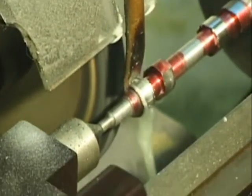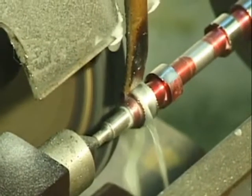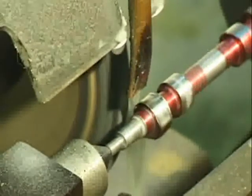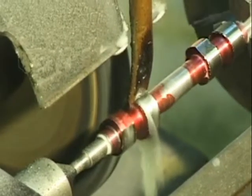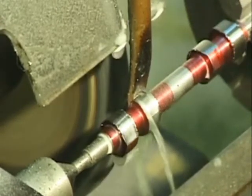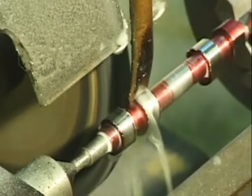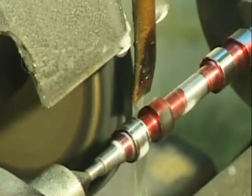You can see the Y-axis and the rotary axis are both moving at the same time. Therefore the Y-axis is moving in and out as it generates a shape, and then that goes over to the next cam, resets the zero. By resetting the zero with a G92, it allows you to use the same formula — that's the G-code for each cam.